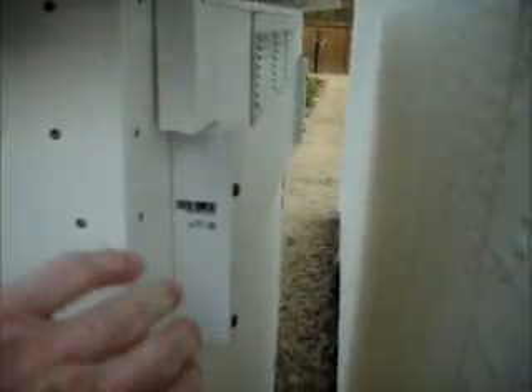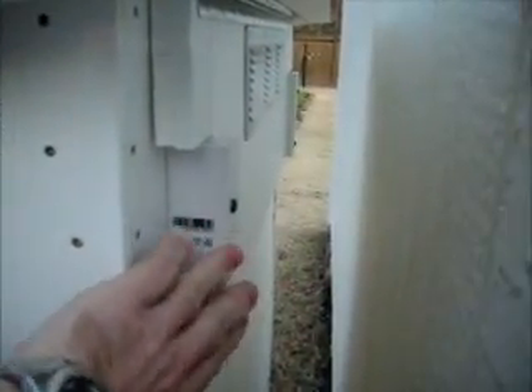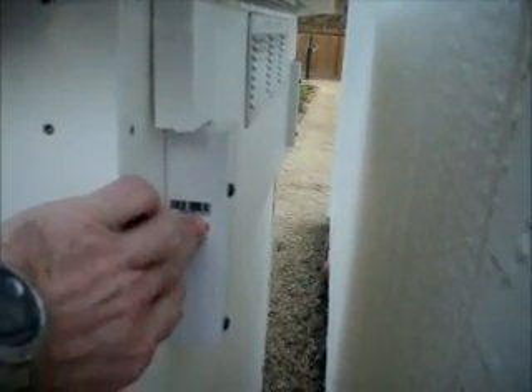While showing the back, you can see I have two two-by-two PVC pieces screwed in with a three-eighths-of-an-inch groove cut into them, so if I ever want to take the top off, all you have to do is unhook the front, lift it up, and they'll slide right out. For ventilation: six vents total — three-inch vents on each side, a three-inch vent at the top, and three two-and-a-half-inch vents in the back. It's covered with an aluminum soffit vent, pop-riveted in, and there's the stainless steel hinge.